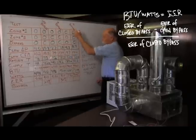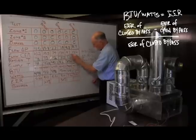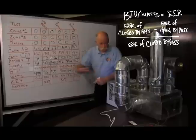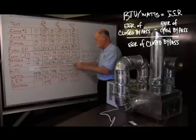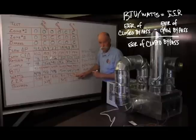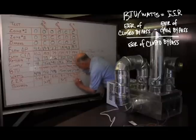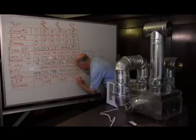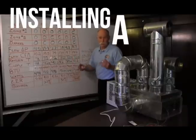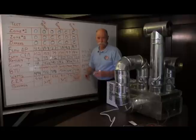Now we're going to do it with the other zone, and the other zone goes through the same thing. You get more airflow going all the way from the room through the machine and out into the room, instead of going in a circle. Our efficiency went from 7.42 to 9.45, and that is a savings of 22%. I hope I've convinced you that a bypass is dumb. Thank you.